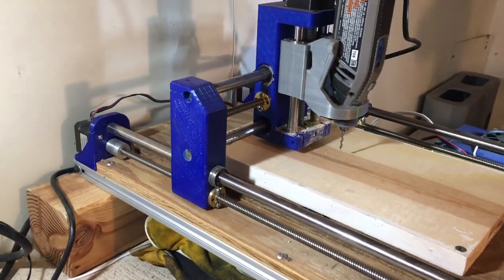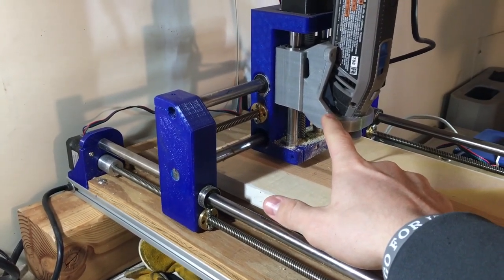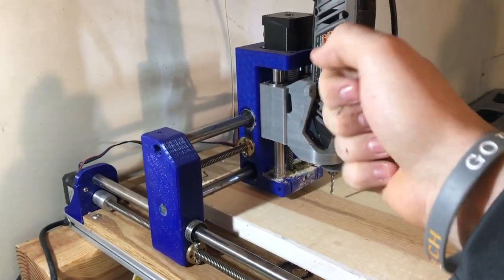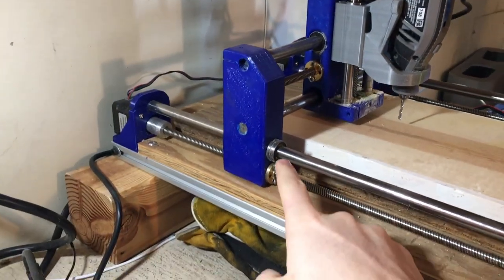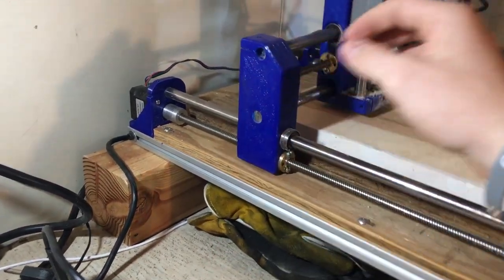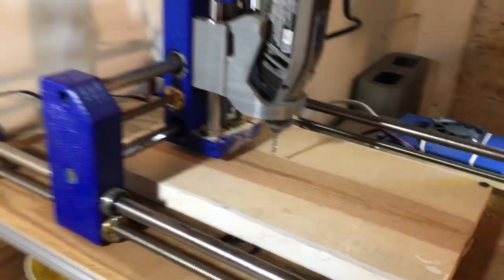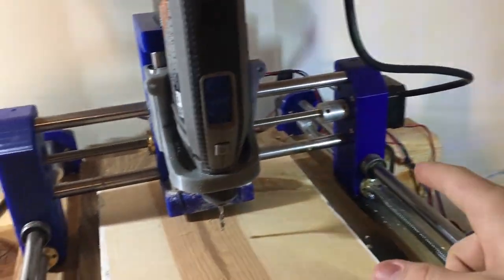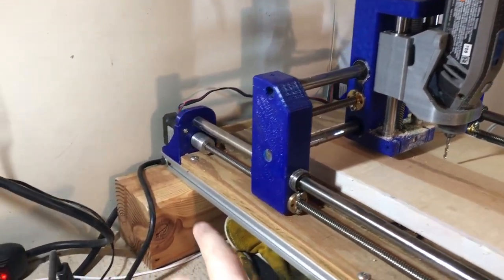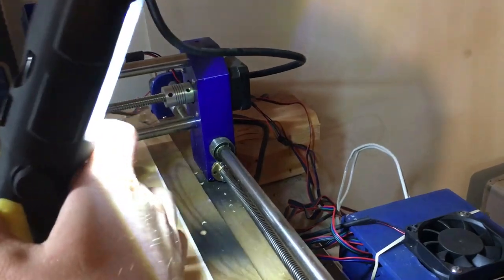To quickly go through some of the upgrades I've done: obviously the z-axis carriage upgrade that he put out helped a lot. I put two linear bearings on each side, which helps with the slop right here. I also ordered some more bearings — as you can see they overhang, so there are two crammed in there. It still has some slap but it's not near as bad as it was. I also greased these up a little bit.